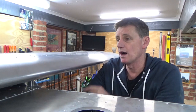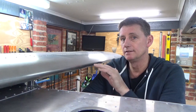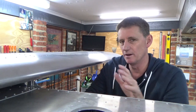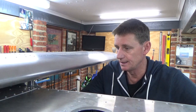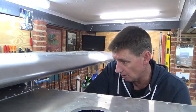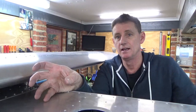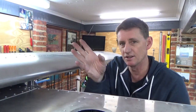Tailplane has to come off and be painted. The way I've done it — I haven't riveted the hinge, so the hinge is riveted to the elevator, which is above my head here. I'll probably paint and just have brand new shiny rivet heads on top of the elevator there. Or I'll paint the whole assembly together. I think it's better if I paint them separately to get into the hinge line. So from here I think I'm going to pilot hole — you can tell I'm a bit nervous about drilling these holes, because if I stuff this up I'll put it on eBay as slightly used.